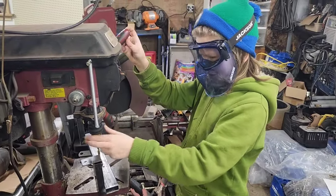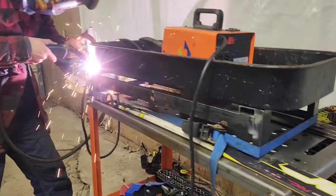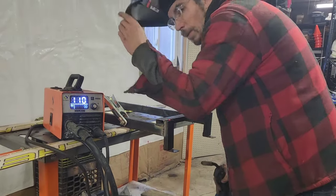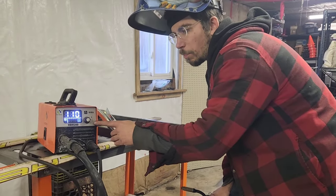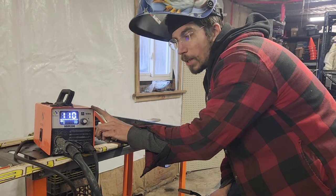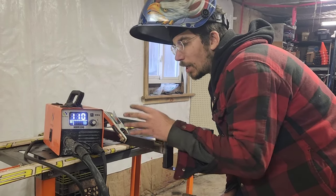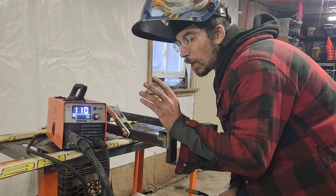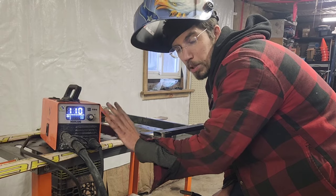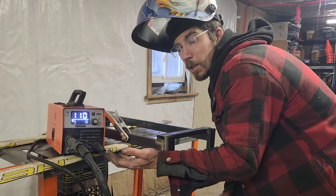What did you do? It's tight — it's everything. Dad's tack-welding it right now. To answer the question I get all the time about the little Hitbox 200 versus the VEVOR 130 — there's a reason this is $30 cheaper: it only has one dial. It is only good for fresh mild steel. If you're doing anything that's got rust, anything you've got to burn through a coating, the VEVOR does better. It's worth what you pay for it, but the VEVOR at the end of the day is still a better unit if you can spend the extra $30.